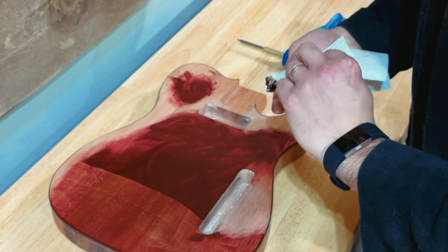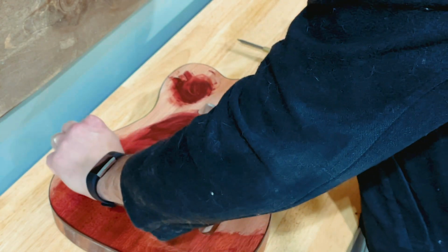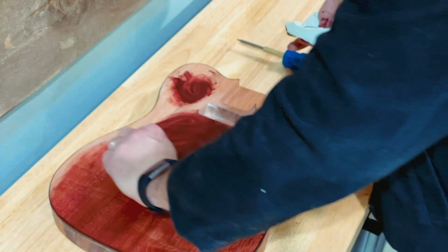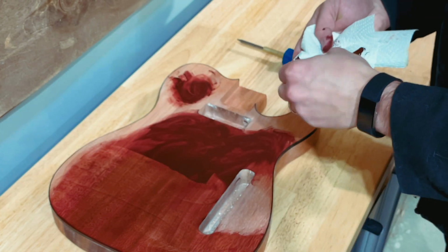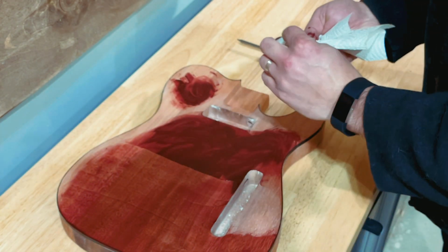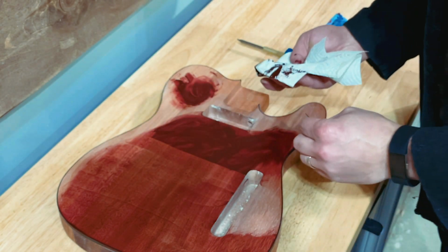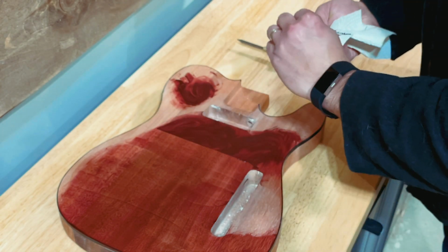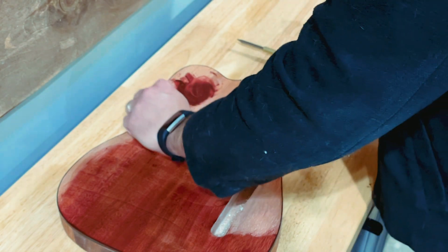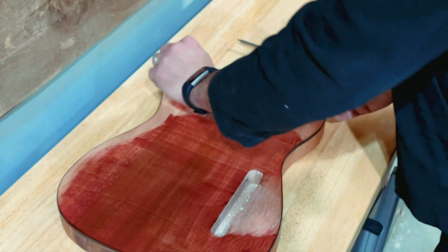And then I can sand after. So I'm kind of accomplishing two things at once. I'm basically staining the wood like an oil-based stain would, and I'm grain filling. So I end up with a nice smooth surface, and I can apply what I need over top after if I want it to be nice and glossy. You can let this dry longer before you do it, and that will help you avoid some shrinking. But it's not necessary, just sometimes we need to do this a couple times to get the desired effect.